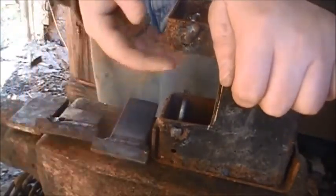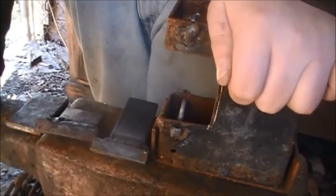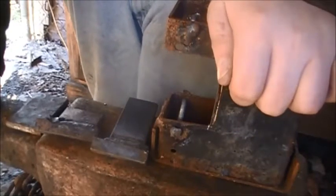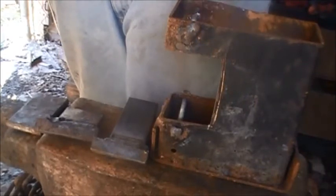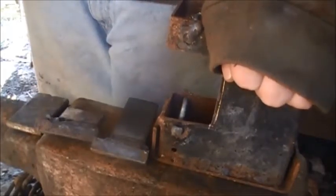Because I can put in any type of die I want since it's a little bit loose fit. The disadvantage is it's not as accurate as one of the other ones that you could buy or build by putting in slots that fit in nice and tight. But I'm okay with that because I can clean that up at the anvil, or just take a little bit more time and make sure everything's lined up a little bit better before I hit it.